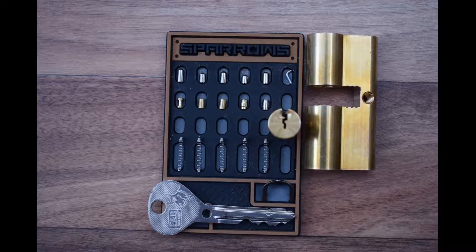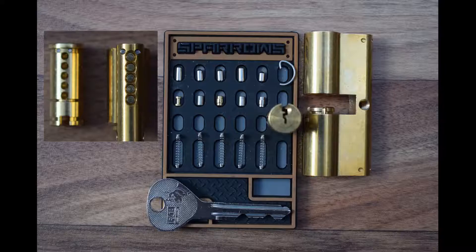Interestingly enough, FAB's marketing materials argue that the harder it is to assemble the lock, the harder it is to bypass it for thieves. I would say this claim is a bit disputable, but marketing materials usually are that way. Unfortunately, the locksmithing community didn't share this point of view, which in the end sealed the fate of the RSG version. The lock servicing was harder and more costly due to the need to cut a special service key to allow disassembly of the lock. Also the defective lock often had to be sent back to manufacturer for repair, so the community rejected it, and the RSB version is currently sold instead.